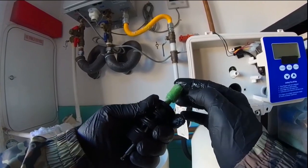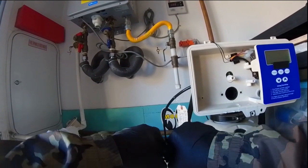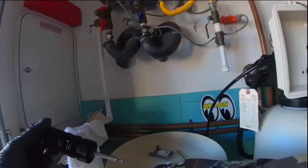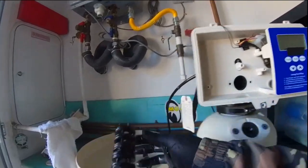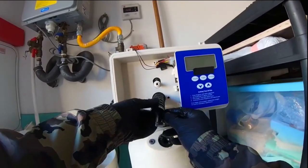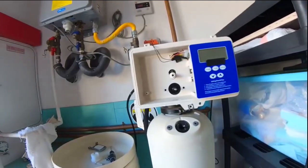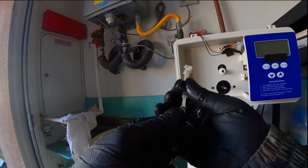Once you're done, push it all the way down until it can't go any further. Grab the other half and simply twist it back on until it's nice and snug. Then grab some more grease and do these outside O-rings here — there's no such thing as too much. Grab the piston and push it back all the way in from the black part — not from the silver part, but from the black part. Next, grab the brine piston and lubricate those O-rings as well.